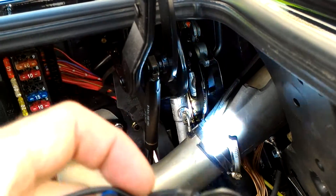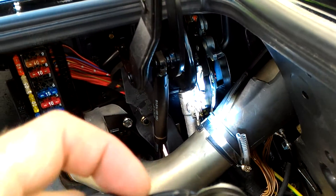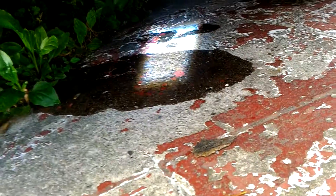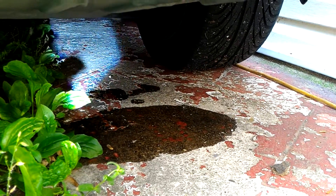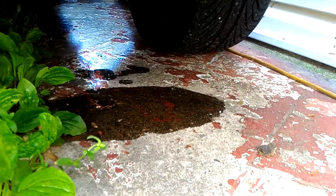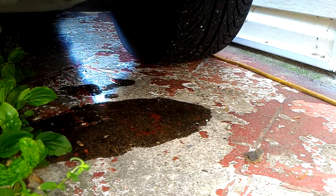So I'm going to do these. And also some general information: if you have the leak right here behind the wheel, those are your rear cylinders leaking. Now, I don't know about the main lift cylinders — the main lift cylinders will be leaking from that area right there. Those are the main lift cylinders leaking in front of the rear wheel, not behind it.